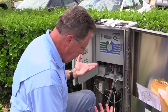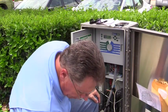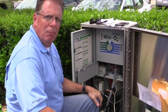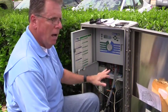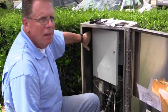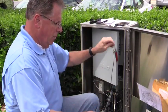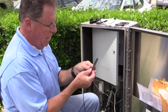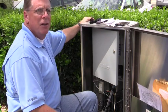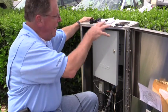So we'll go ahead and hook up this hermit crab — this is a demo install. One of the problems with these stainless steel boxes is they do a very good job of blocking the cell signal. So even though the hermit crab can be inside the box, I need to get the signal outside to be able to communicate. These boxes have a nice vent with louvers on the side. What I have is a very inexpensive 3M sticky antenna. We're going to force the cable through the vent and mount the antenna on the outside of the box — it is very nondescript, and this way we get our cell signal outside of the stainless steel enclosure.